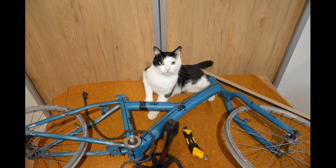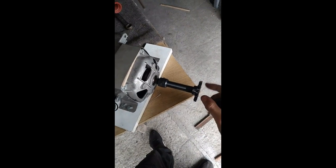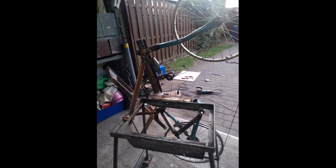I wanted to show you guys how the clutch works. The clutch is made of three parts: the shaft, the blade piece, and this collet. I designed it so that if the chain blocks, those blades will break, allowing the shaft to run inside the collet without damage — the blades will be broken instead. After putting it all together, it was time to do some testing.